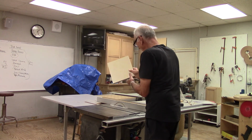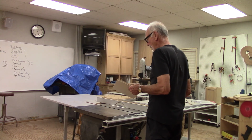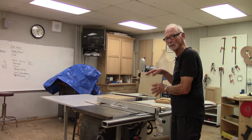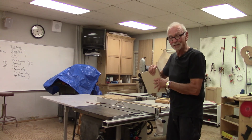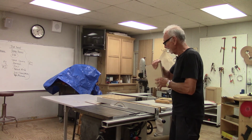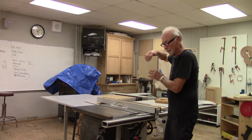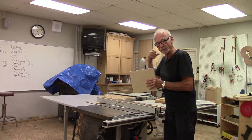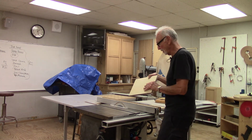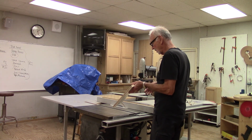That's the cut. Now, when you cut a rabbet, that's your first cut, the material on end. Now, if it's a long, like a jamb leg, a 6/8 leg or a 7-foot leg, it's pretty tough to hold that up and run it through a table saw. Those you might want to do on the flat with a router, radial arm saw. There's a variety of other ways to do that. So that's our first cut, right?